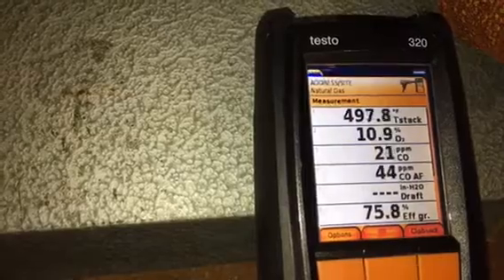And the age of the system — that's why it's 76% efficient right now. But a half a turn brought that down from 40 ppm to right now 20. Looks like it's going to hover around 19-20.